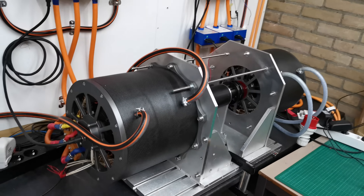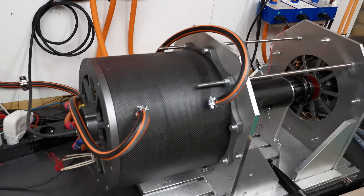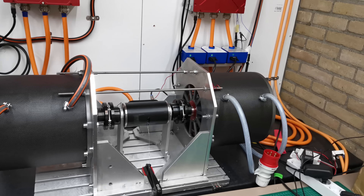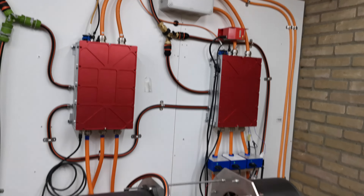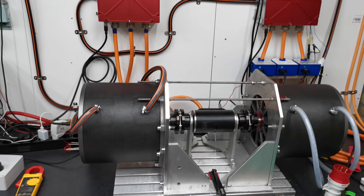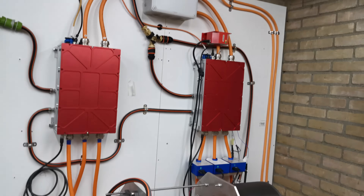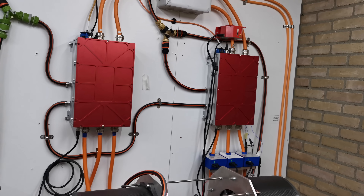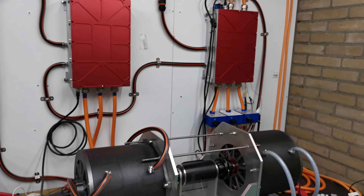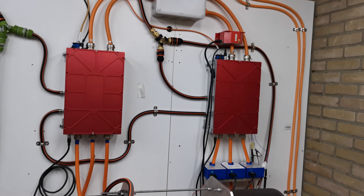The efficiency recorded on these motors was 98%. They are made as a special order — carbon fiber sleeve, so very light for the output power they give. They can deliver continuously about 125 kilowatt, maybe 150 depending on liquid cooling and flow. The controllers can also deliver around 500 amps peak, continuously basically, around 380 amps RMS at 700 volts DC bus.